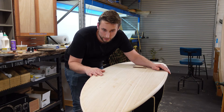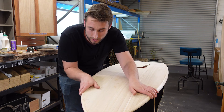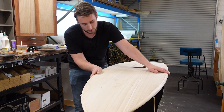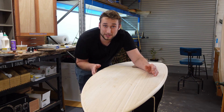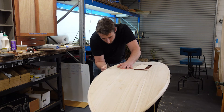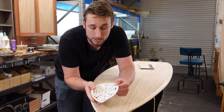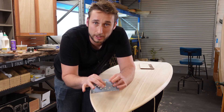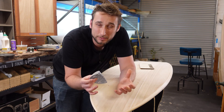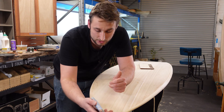Once you have your underside roughed in, once again come over it, feel it with your fingers, get in the creases, and just feel that it's symmetrical and feeling nice and even on both sides. Now if it's feeling good, now's the time to come in and clean it up — tune it in — and you can do that using either sandpaper or a rasp, or obviously a combination of the two. This sandpaper is just an 80 grit disc that I folded in half. I like the cloth-backed ones because they last a bit longer and they're a little bit stiffer, so they don't dip into all the valleys and do a better job at smoothing things out.